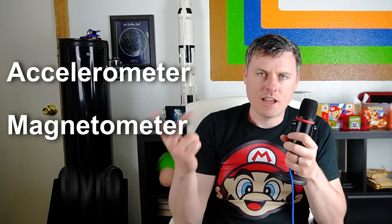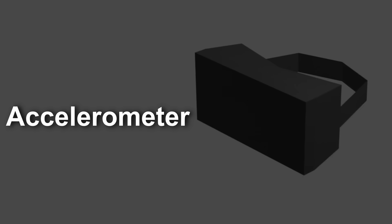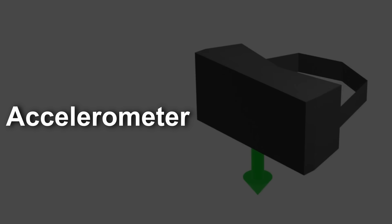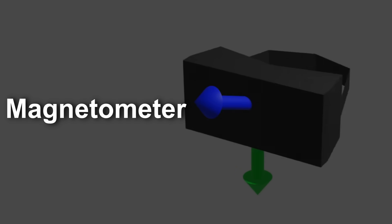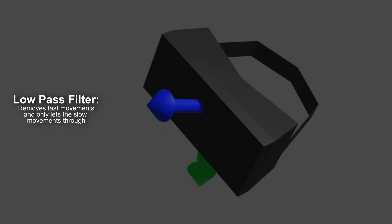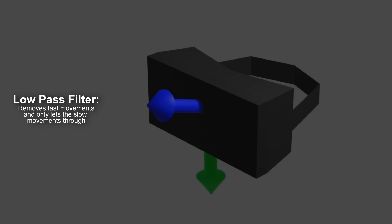To summarize, there are three sensors: the accelerometer, magnetometer, and gyro. The accelerometer points in the direction of force, so that's typically gravity — downward. If you wiggle, though, it's not very accurate, which is the downside of that sensor. The magnetometer tends to point towards magnetic north, and between those two vectors, you have enough to determine an orientation of the headset. But because of the shakiness, I have to pass it through a low-pass filter, which makes it lag behind the actual head orientation, but it's a lot more stable.